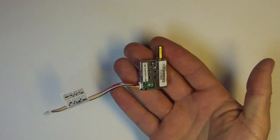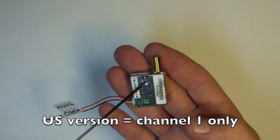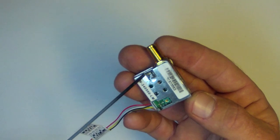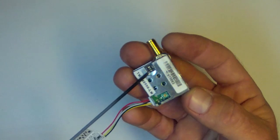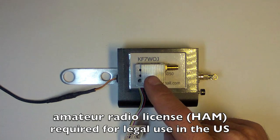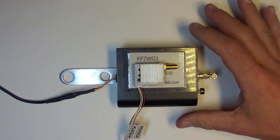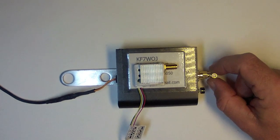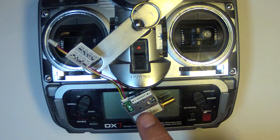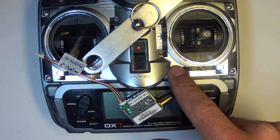To be legal in the United States, this 2.4 gigahertz transmitter is set on channel one, and epoxy has been applied to the DIP switches so that it cannot be changed. To legally operate a 500 milliwatt transmitter in the United States you need a Technician class ham license, which you would also need to operate a high power UHF control transmitter such as the Dragon Link. Be certain you don't try to operate your 2.4 gigahertz video transmitter with a 2.4 gigahertz control transmitter.